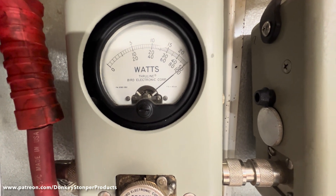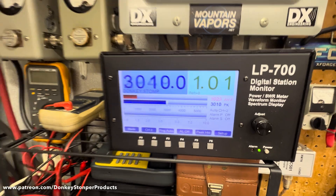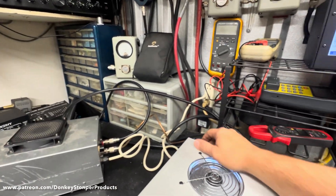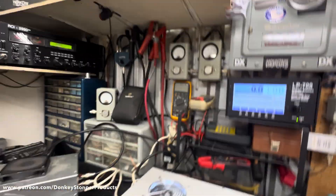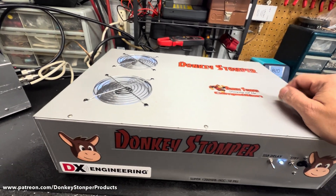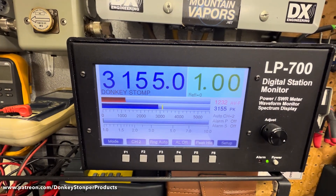That's some real good numbers right there for a 10-pill. When it gets too hot it will quit keying - the slider goes out and it just won't key. Hopefully you won't get it that hot, but if you drive too hard and it gets too hot, it's gonna let you know. Hopefully that'll save some transistors - knock on wood. Since I've been using thermal protection I haven't been getting blown transistors back as much. It's slowed down returns because they kick off instead of eating the transistors.